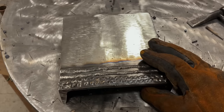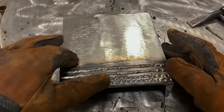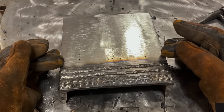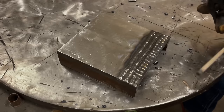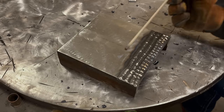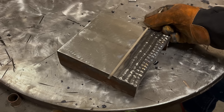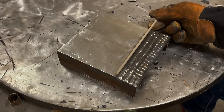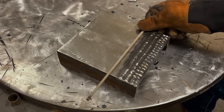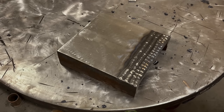Our next step is to run a whole rod end-to-end. A quick tip for gauging whether your rod will make it: on a flat weld, compare the rod length to the weld length. If you have at least 20% of the rod left when you lay it flat over the metal, you'll make the whole weld. On fillet welds that won't necessarily work since you're depositing more metal, but for bead-on-plate we're well over that mark. Always use whatever rod you've got — restarts are fine if needed.